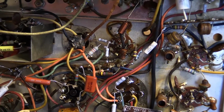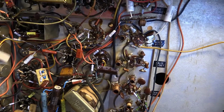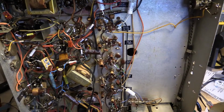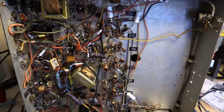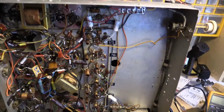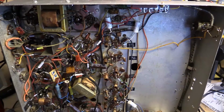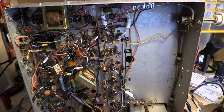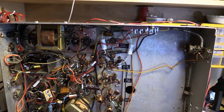I wish I had known about this 7500. The SAM schematic for this thing is just so wrong. It has so many wrong values, and it even has wrong tubes listed. I don't know. This is the third SAM schematic that I've had that's been really mistake-ridden, even more so than the Philco, which on my Philco radio was bad enough because Philco made mistakes and so does Sam's. So anyhow, I'm going on the Hoffman schematic now, which kind of sucks because Sam's puts a lot more information on there, like more voltages and what your sine waves should look like, or your scope stuff should look like. But anyway, I will be back in the next segment after I replace the feedback cap there and see if that makes any difference.